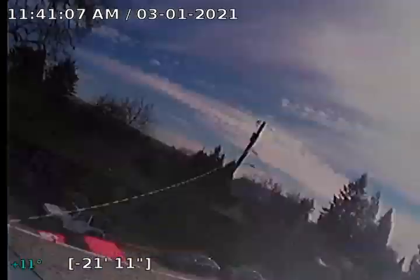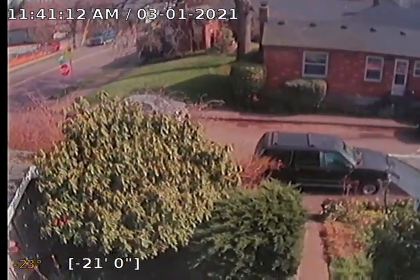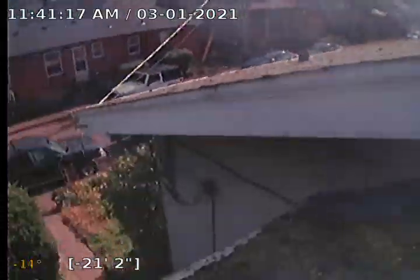Coming back to the vent stack here. Coming up the vent stack, it's a failed sewer scope inspection due to the condition of the line with roots entering multiple joints throughout the run. Recommend a replacement, but I was not able to confirm or deny that it is a party line or a non-conforming sewer line, as the sewer line is running out straight towards the street. It ties into the main heading east at 9 foot 8 inches deep. I was not able to see any additional connection points, but that does conclude the sewer scope.